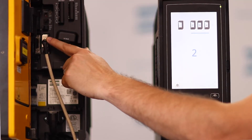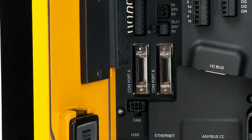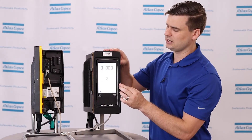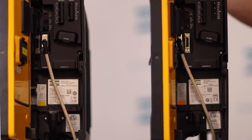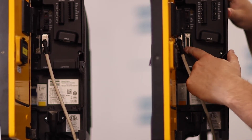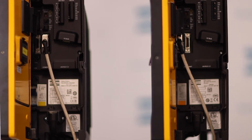Next, you're going to see what's known as the Sync Communication Cable. That is going to plug into the COM ports on each individual Power Focus 6000, and those are going to daisy chain between the two controllers. For example, this one is going to go from COM port A into COM port B of the second controller. If we had additional controllers, we would output from COM port A to COM port B of the next controller.